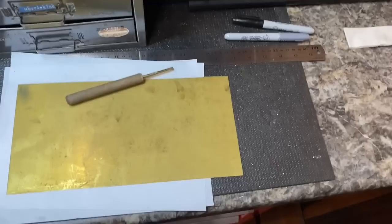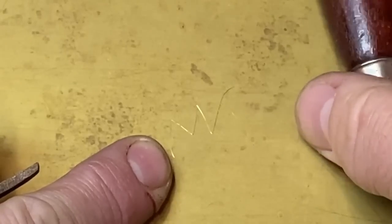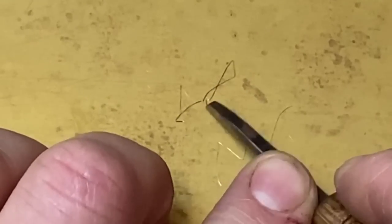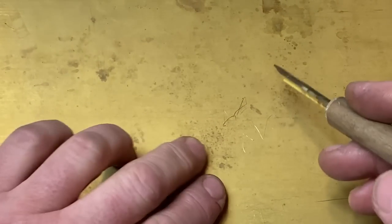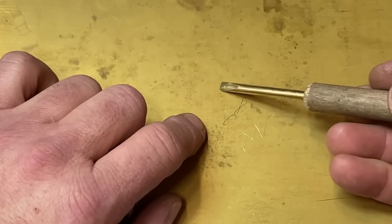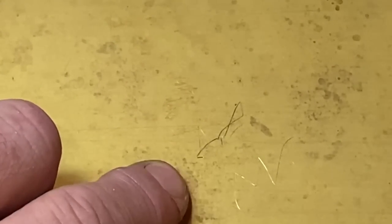Let's zoom this in. When you're scraping — let's say you make a mark — that steel cuts right into the brass. Now if we're using this one, it'll slip and get away from you and it really gouges up. Brass is not harder than brass, right? Steel is harder than brass, so it will cut and make marks. The brass just rubs on it, so it leaves a little bit of a mark, but not nearly like these two.